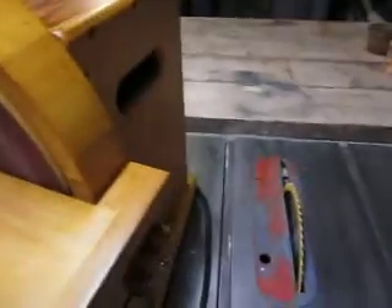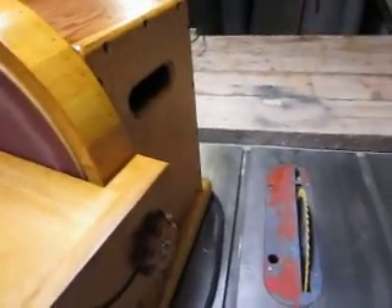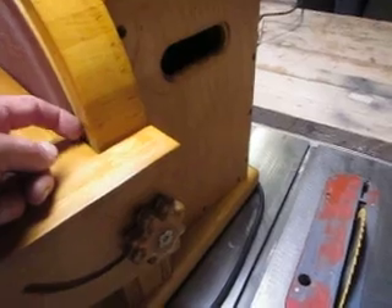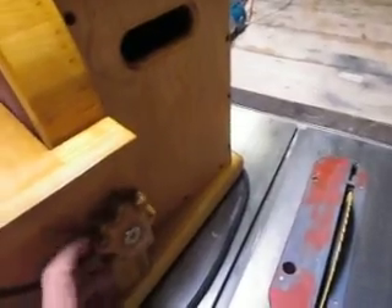Like I said, I didn't care much about the overall appearance — I just used whatever scraps I had. The next part I made was this table. The way it's fastened: I found a piece of piano hinge and cut slots for quarter-inch threaded rods, with a washer and nylon nut on the other side.